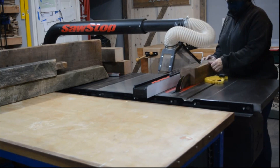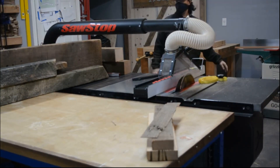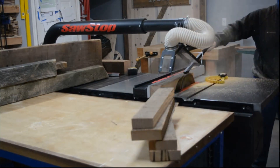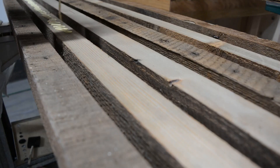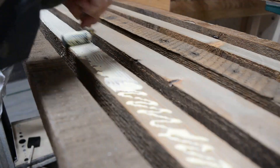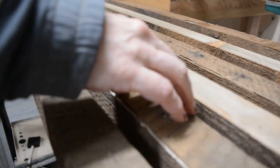The shelf can be made by cutting fresh lumber to dimension or by milling reclaimed wood. For this project, I used reclaimed Douglas fir barn boards. It's a messy job, and I added a level of difficulty by deciding to retain the natural warm patina the boards had accumulated over the past century. So for every side that I ripped, I reapplied a piece of veneer. Each board ended up with two original sides and two fresh edges in need of veneer.